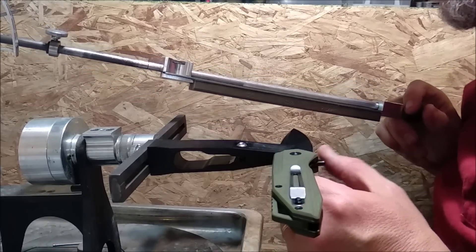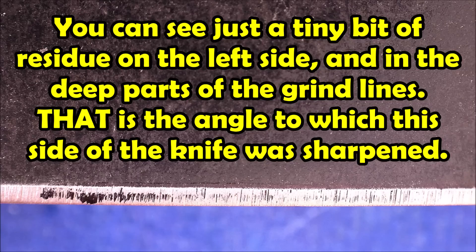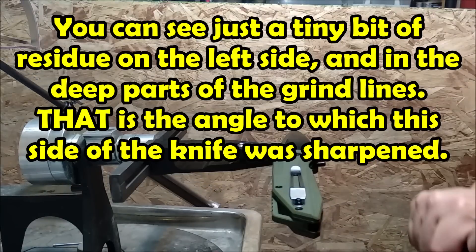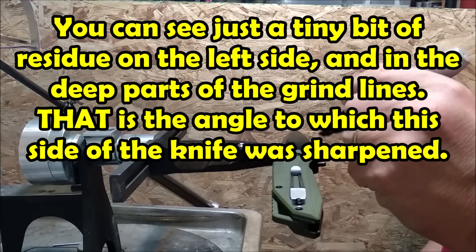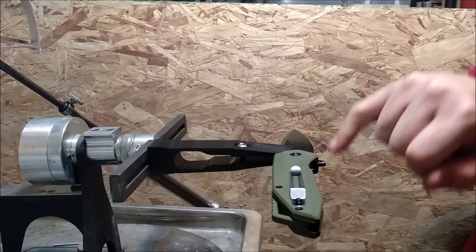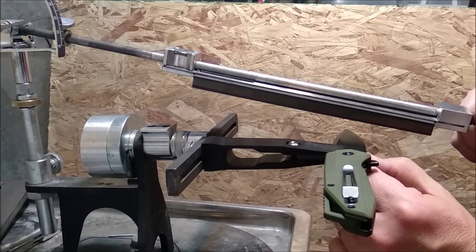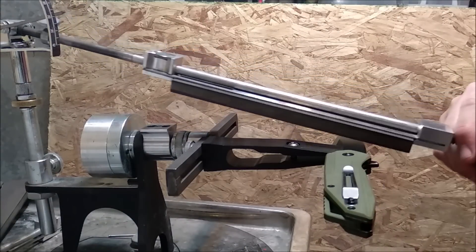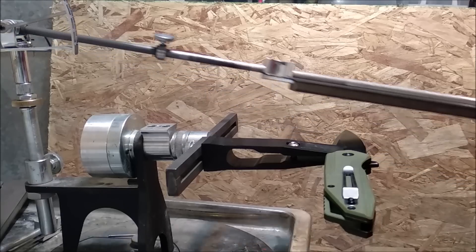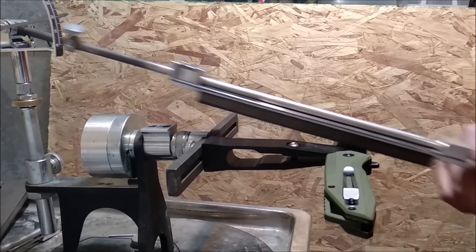That has wiped away all of the ink. Now to double check it I'll redo it, because I did that after it was already half wiped away. This will tell me if I'm still wiping off right at the cutting edge, or if I'm only wiping off on the shoulder. Yep, that's even all the way across.